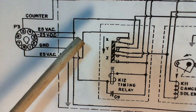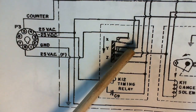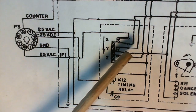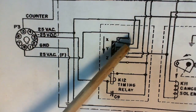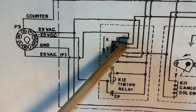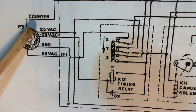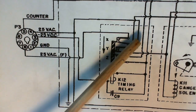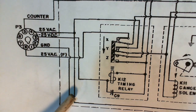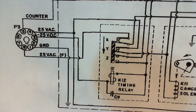Okay, so just to review again, this connection point is actually made right here. If you look at this point, there's two wires coming off, the two I soldered back on, just one of them being the burned one. So the one wire comes out to here. The other wire comes from here, goes all the way around, down, and over to the other side, which is the wire I replaced.